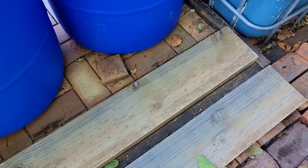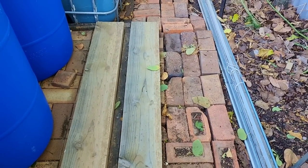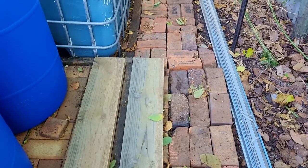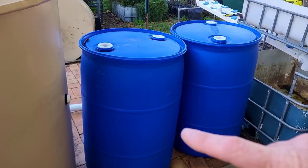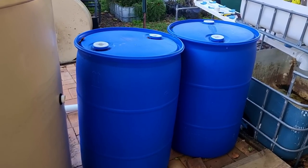I could have used timber and ply but they're just going to rot out and go spongy over time - both the aluminum and the plastic will stay nice and secure. This here is level and will easily take the weight of upwards to around 400 kilos when the two filters - one settler and the bioreactor - are full of water. So now I'll go grab the jigsaw, lay a tarp down first, and get ready to flip this one's lid.